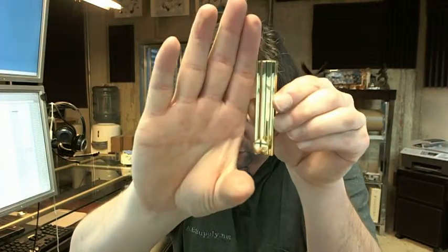Surface bolts like these — small ones like these — are used in a variety of applications: holding small cabinet doors closed, doors that are smaller in nature, or foot lockers. I have seen them used to hold lockers closed with different sorts of configurations to the lid. There is no hard and fast rule of when you would use this, however it is a 3 inch bolt so it is relatively small. Access to the fastening hole there and then there — four screws total, two here and two for your strike, whichever one you will end up using.